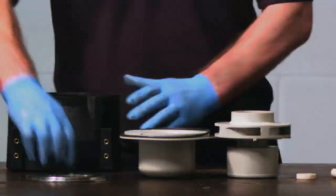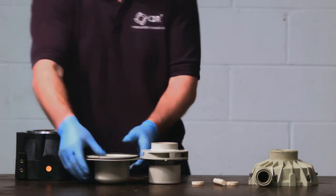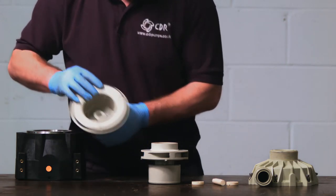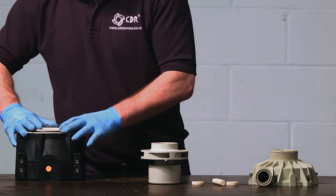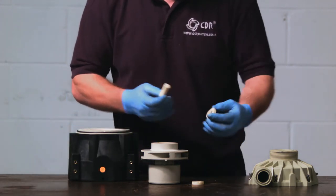You can have an ETFE assembly. Bear in mind that if you have an ETFE isolation shell, you will also need an isolation shell cover which adds extra strength. The static and rotating bushes and axial thrust shafts can also come in silicon carbide or graphite.